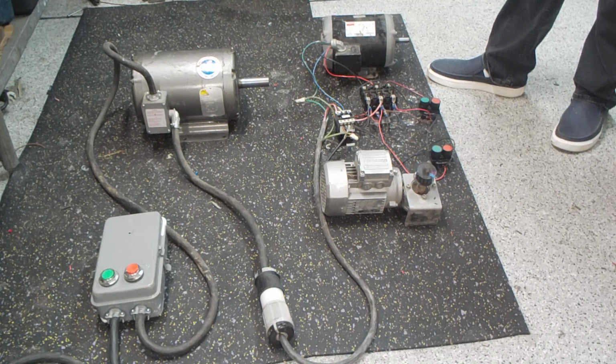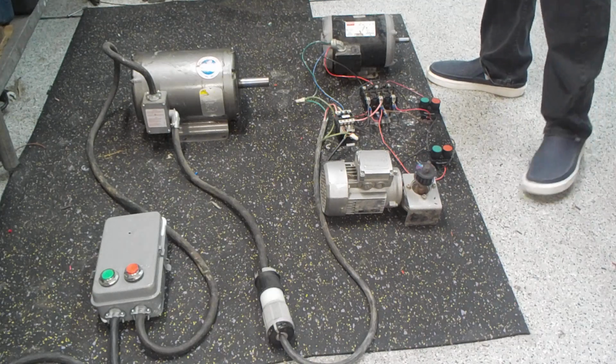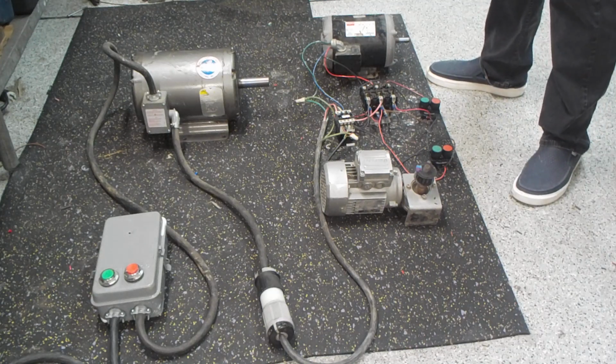So we're pulling just a little bit more than 3 1/4 horsepower from the 5 horsepower rotary phase converter, and it's happy as a clam. It could run this basically all day long if it wanted to. We don't have a heat issue with the 5 horsepower motor. Trying to run smaller motors, actually the field gets better the more of these smaller motors that you run. The 3rd phase becomes stronger with every motor that you install to it.